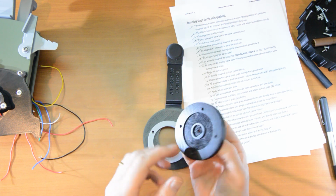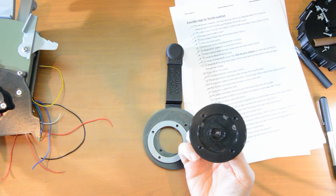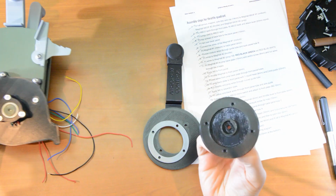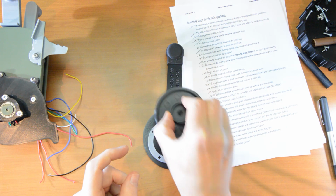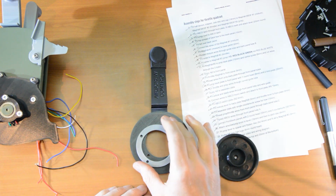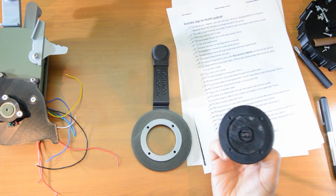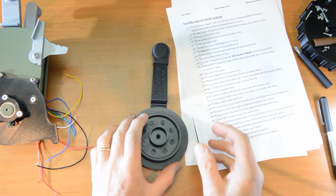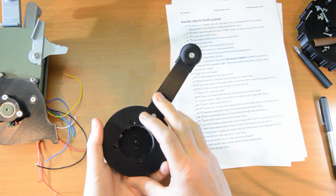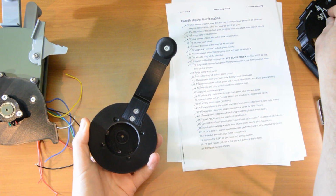Right, this is the order of things. Have a look at the D shape here. Remember how the D's have to line up to the top of those mag holes? So that D at the top like that. The air screw lever there, and 4 holes here which are going to align with 4 holes there. Put it that way round roughly, and then turn it over, and then we're using 4 times 14 mil to connect this up.